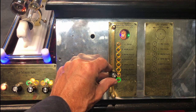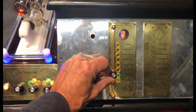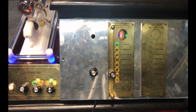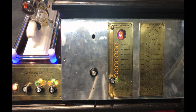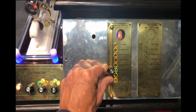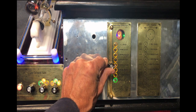Here, I'm sliding the switch knob up or down to select which pattern to display on the Decatron tube. There are 8 options on the slide switch. Notice, the knob contact glows green on whichever option I land on, in this case number 7. It will stay green for a few seconds. The number is reflected on the Nixie tube. After a short delay, the up-down standby mode chase will begin. When the slider knob is moved to a new contact, that value will be displayed on the Decatron and Nixie displays.